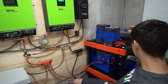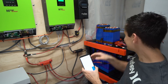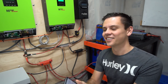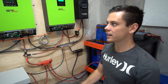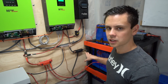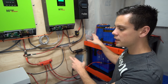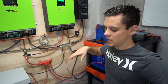Actually, if I add this pack and this little pack down here, that would give me 19 kilowatt hours — if I hit 20 kilowatt hours that would be absolutely incredible. In the first day to test this and do a full cycle, I pulled nine kilowatt hours with my jacuzzi, then ran a heat gun until one of them tripped. I charged up the ones that were in safety mode and everything works great. The hardest part was putting them in series — I had to charge all the batteries manually. I ran the entire system off the BYD pack, charged up all the other batteries with the incoming solar, then waited until the BYD pack was fully charged before series and parallel connecting everything.